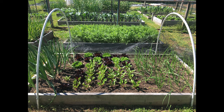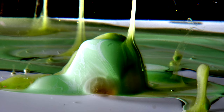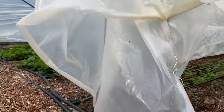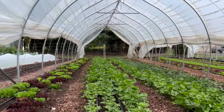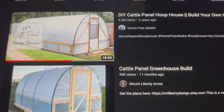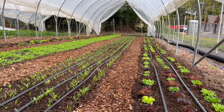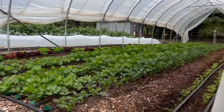As I did more research, I learned that when PVC and greenhouse plastic touch each other and are exposed to UV light, there's a chemical reaction that will degrade the greenhouse plastic very quickly. PVC is also not made to withstand the elements, so over time it'll degrade from extreme heat, sunlight, and cold, and your structure will likely not be usable in just a few short years. I also saw cattle panel greenhouses — a cool option for something small, but not good for high ceilings or widths over five or six feet. If you've used either method successfully, let us know in the comments.